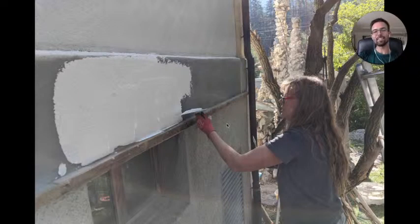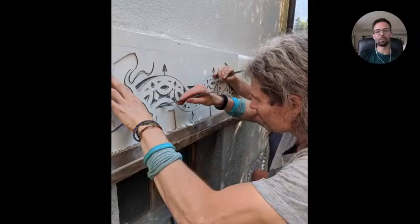Then that dries, and a third and then finally fourth layer of lime. Man, I should remember what this is called properly. I'm calling it lime plaster now, in German, Kalkputz. So one layer, smooth it out, let it dry a bit, and then second layer. And then while the last two layers are wet still, or moist, we scratch.